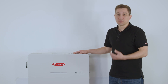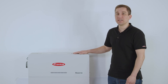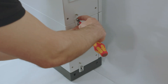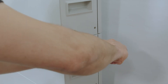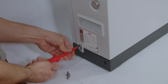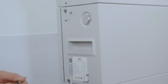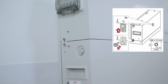Depending on how many modules you install per system — between 2 and 5 modules — on the last module you place the battery management unit on top and screw it down the same way as the modules. Please note that you need to do the mechanical screwing on both sides. To finalize the installation please use a 5 Nm torque.